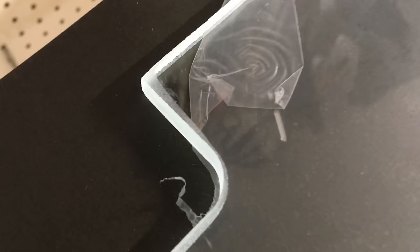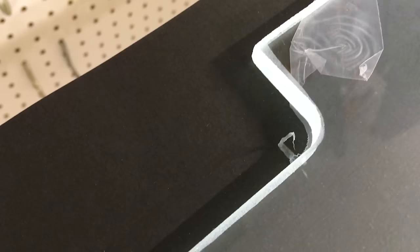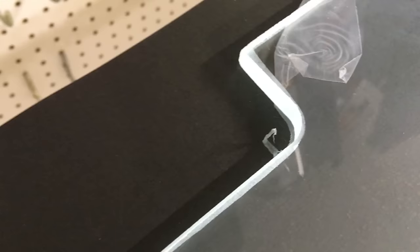But if you're speccing out a very custom shape, or even something like we had to have a notch here for where a microwave goes. And clearly, they may have water jet cut this whole piece, but then they just beveled the outside by hand there. A little funny and sloppy. So it is possible to get a really nice piece, but you just need to make sure the company that's supplying the glass is going to do a really nice job and use a nice water jet cutter for you to get a nice corner there.